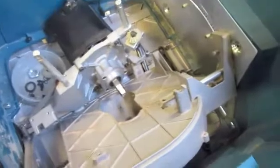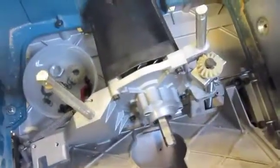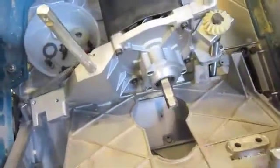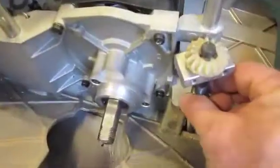So I have taken off these gears, circlip tool and all that, disassembled the gearbox, the part that I had to replace originally, and I needed to get to this, what I'm calling the bar, which is actually the adjustment rod. It sticks through there, uses that handle to actually turn this gear. And I needed to do that because that's where this chunk of alloy is going to go.